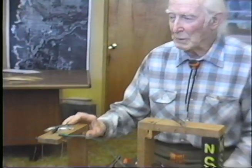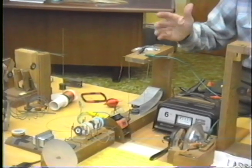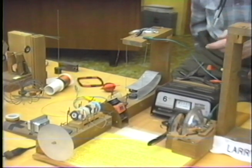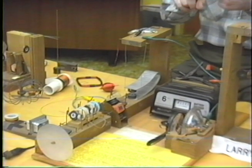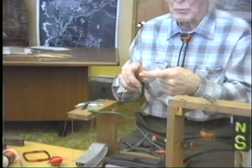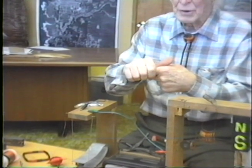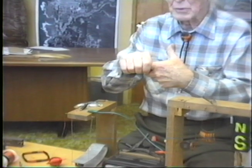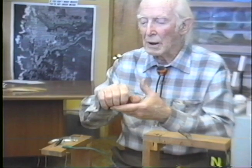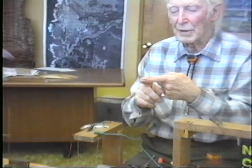Let's move into electric motors. Here is a piece of equipment, and we're going to talk about Hans Christian Ørsted's right-hand rule. If I take my finger as a conductor and there's a current running in that conductor, I can tell which way it is running by the right-hand rule. I simply put my hand around the conductor, and my thumb will point at the source of the electrons. My fingers will point around the wire, and a magnetic compass will point around the wire. With a simple magnetic compass, you can tell that there is a current running in that conductor and which way it is running.